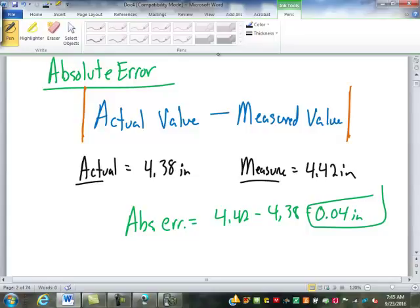Something in machining that's really tough is you're just used to everything being in thousandths or ten-thousandths. If you have something that's actually measured in hundredths, it's really tough not to say 40 because you're used to referring to things in thousandths. But from a technical side, you cannot refer to this as 40 because it's not 40 thousandths — it's four hundredths. There's a big difference because 40 thousandths implies it was measured in thousandths. If you're communicating with an engineer, they hear 40 thousandths and assume it was measured in thousandths. So just a little side note.